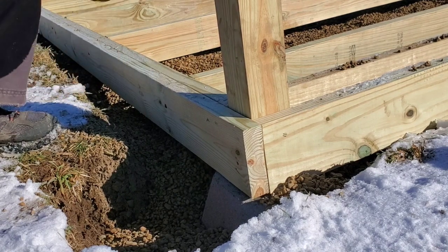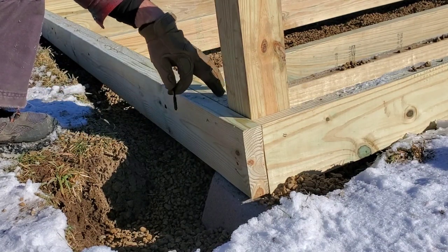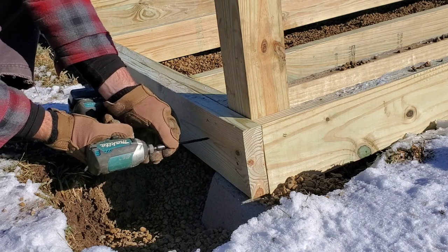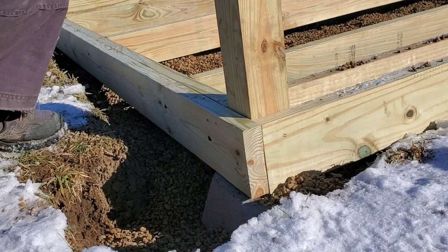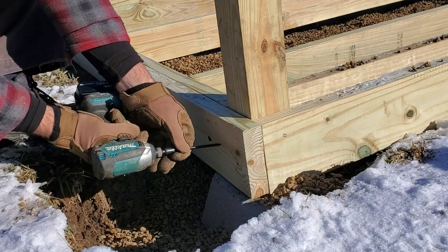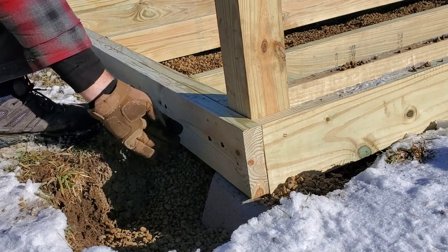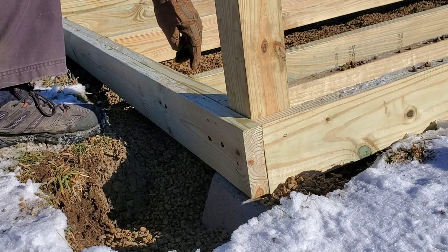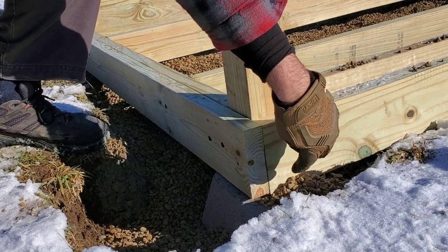So this piece is like laminated together. So what I'm gonna do is I'm gonna put these wood locks. I'm gonna put one through this back one since that's where my inside joist is holding up this one. I'm gonna put another 4-incher beside that into this wood. Yeah, I'm just reinforcing everything.